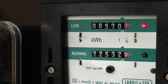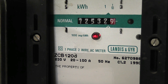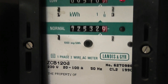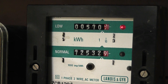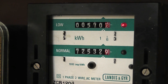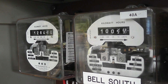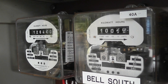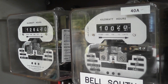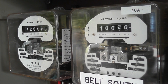I wanted to get this meter on video — I haven't seen this on YouTube yet. This is a ZCB 120D meter by Landis+Gyr, single or two-rate. At the moment it works only on one register. I need to investigate why the other dial doesn't work. This meter now reads 42020 and the other meter reads 20. One is running per single unit and the other on the left-hand side is running per 10 kilowatt-hour units. Really cool — for meter enthusiasts, that's important information.